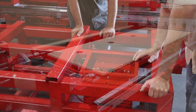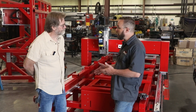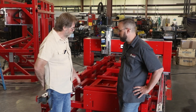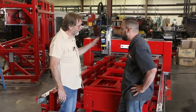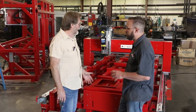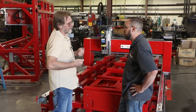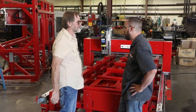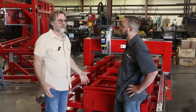The door-making system takes about two hours to put on — what about the other three? For the vacuum pod, you can have them sealed and ready to go with the base table back on in about an hour to an hour and a half. Keep in mind the base table is three feet wide and eight feet long, so have somebody help you lift it off and drop it straight down so you don't shift those seals.